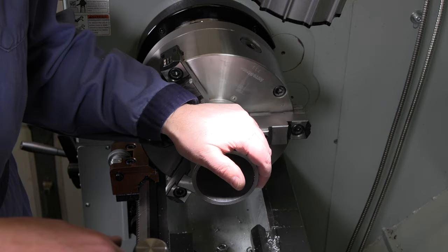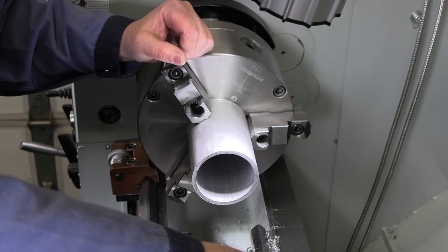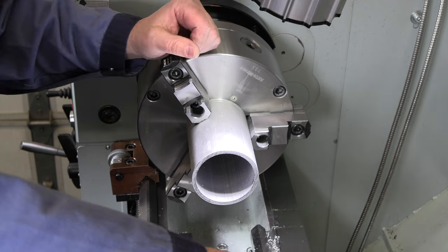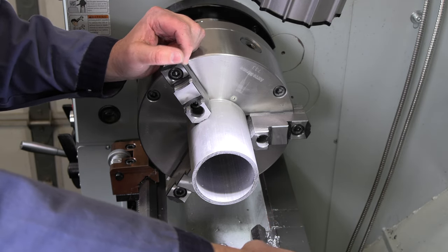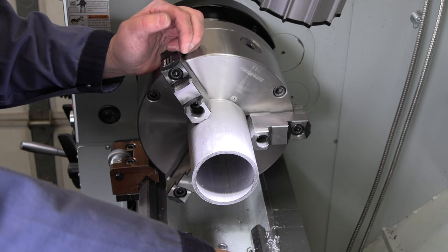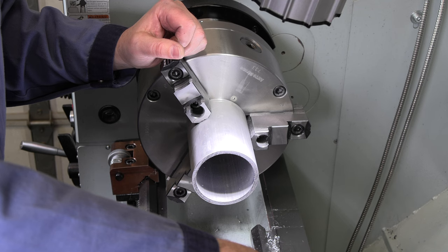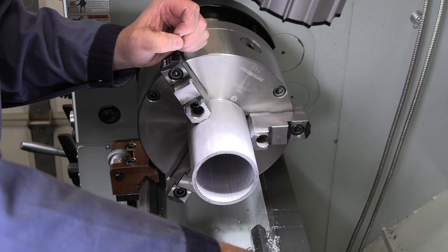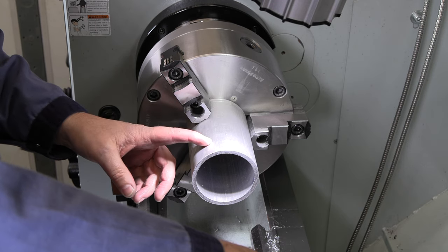And that's really one of the nice things about this project. So if you're making this, there's very few dimensions on this whole gyroscope project that are really critical. Obviously the bearing cups, where those bearings are gonna go into those brass pieces, that's pretty much the most critical dimension that we're gonna have. And then when you're machining the flywheel, the bolt circle, that's probably the part that we wanna be most accurate about to make sure that we're keeping that flywheel as balanced as possible as we're machining it.